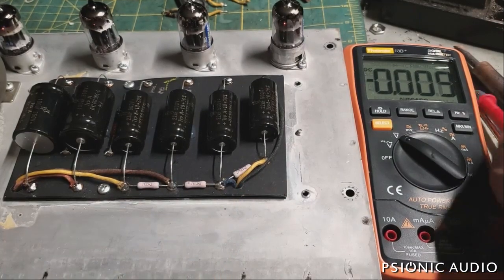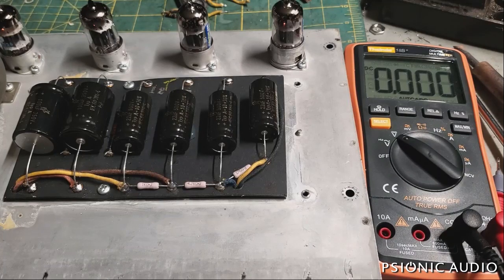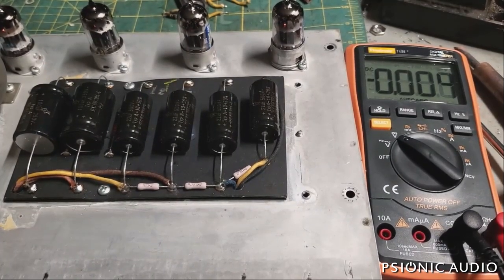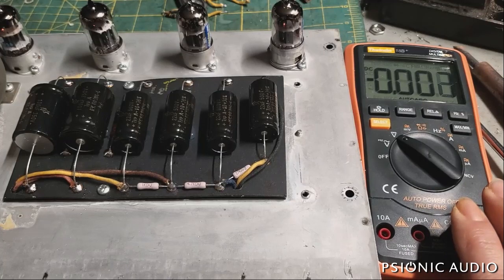Based on what I just measured in this '67 Bassman, you do not have to use standby. You can if you want — it won't hurt anything with one exception. They used a very nice Carling switch for the standby switch in these amps, but that Carling switch is rated for AC voltage, not DC voltage. So when you have 462 volts DC on a switch that was not rated for more than about 30 volts DC, you get problems, and those switches begin to arc. It's a very common thing to replace standby switches in old Fenders — the switch was just never designed for the purpose Leo put it to.